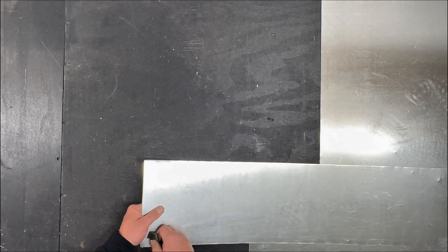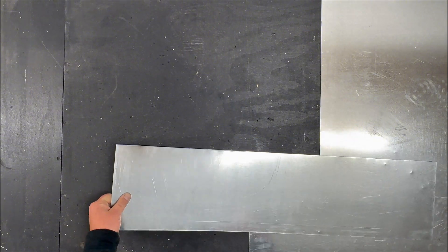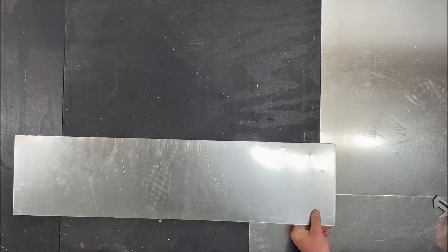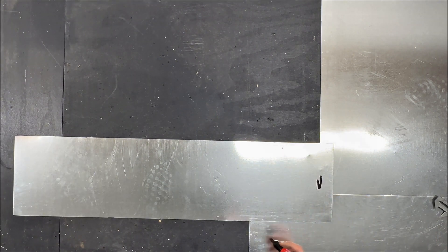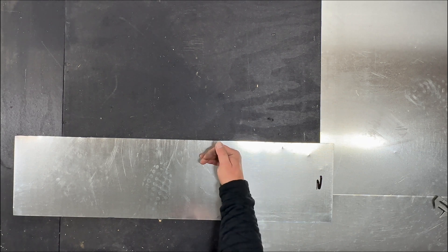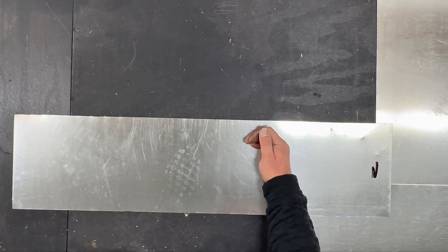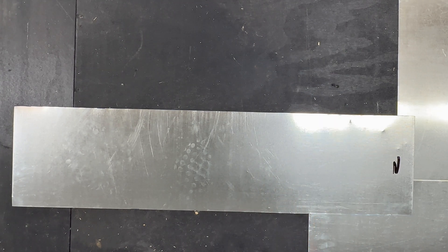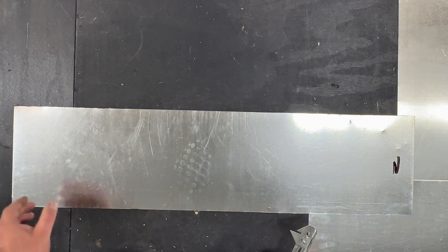The first thing we want to do is make one of our flat sides. I'm going to make the flat left first, so we're going to scribe one inch along the bottom and scribe an inch along the back — that's going to be our Pittsburgh. My fitting is four inches tall, but to make the cradle I need three inches and then another inch for my hem flange, so I need eight inches of material to make my connections.